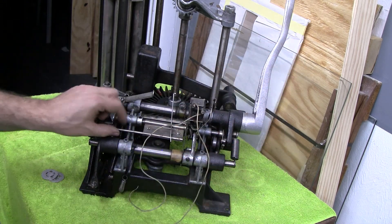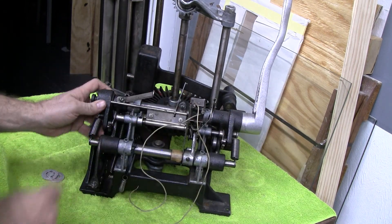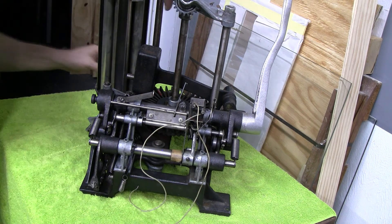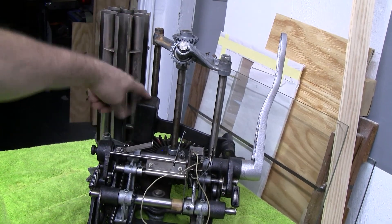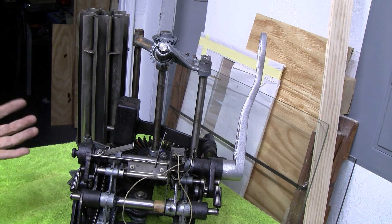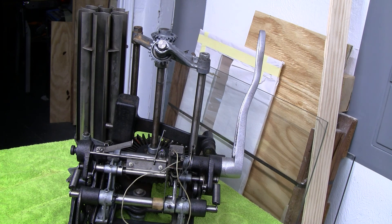I've got everything freed up. I understand how the whole assembly works. It's a pretty ingenious device and it's really cool how the whole thing functions. This right here is the magazine — this is what feeds the tokens down into the thing. This is a hammer that stamps it, and these are the dies. There are two levers on each side: one ejects and one raises the hammer to stamp. Every piece is machined to work intimately with each other and it's just a beautiful concert of mechanical operation.